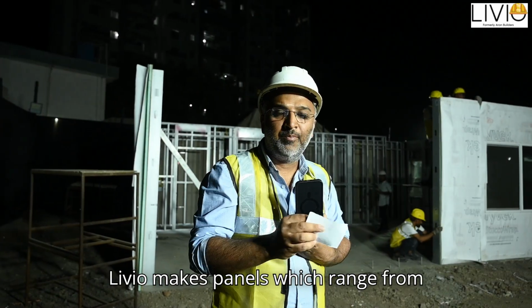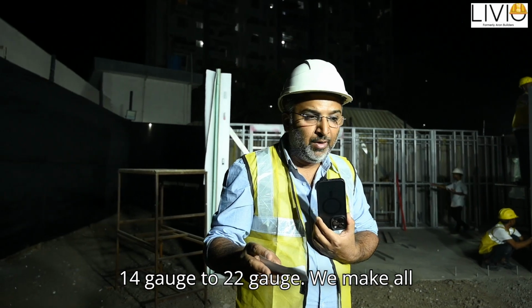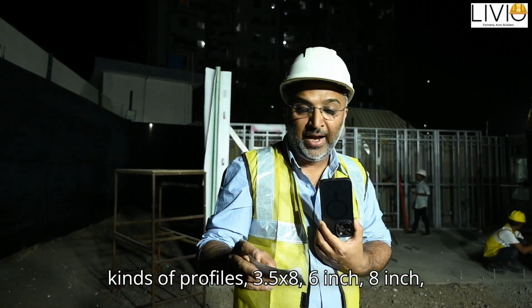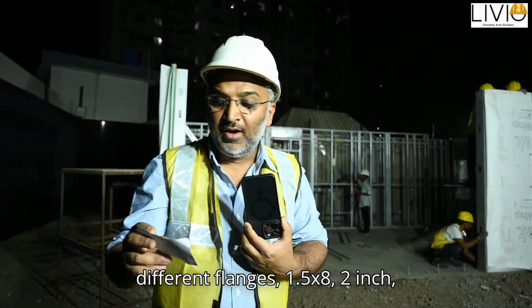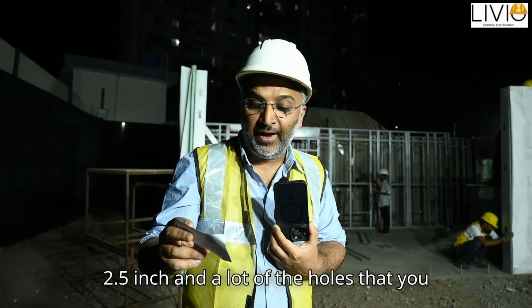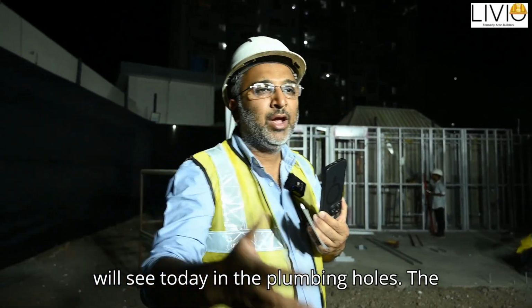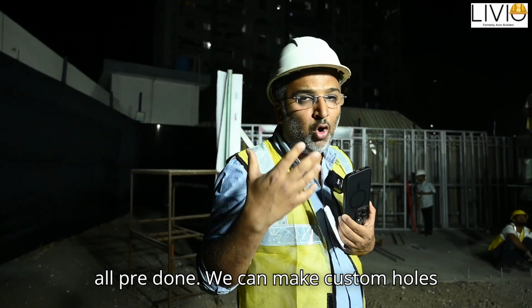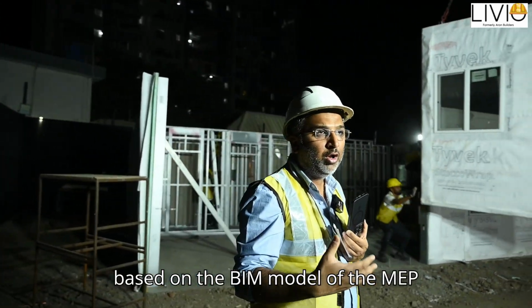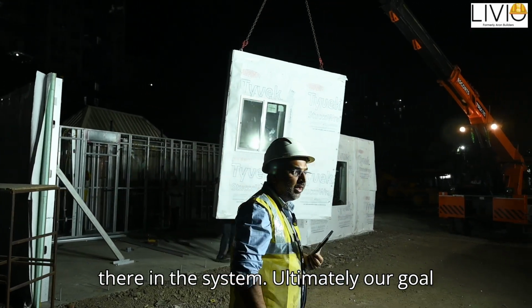LIVIO makes panels which range from 14 gauge to 22 gauge. We make all kinds of profiles, 3 5/8, 6-inch, 8-inch, 10-inch, 12-inch profiles. They have different flanges, 1 5/8, 2-inch, 2.5-inch, and a lot of the holes that you will see today in the plumbing holes, the holes for electrical, they're all pre-done. We can make custom holes based on the BIM model of the MEP services and so on. That will be there in the system.